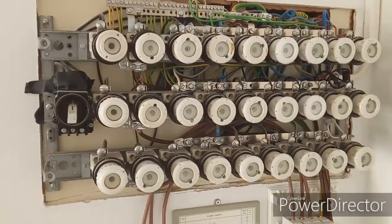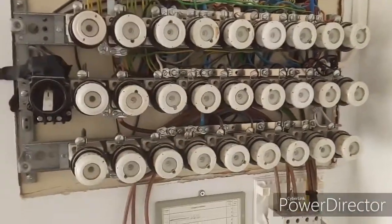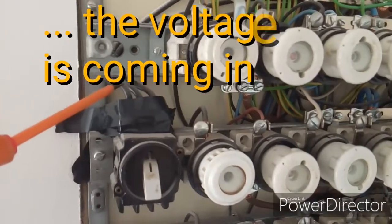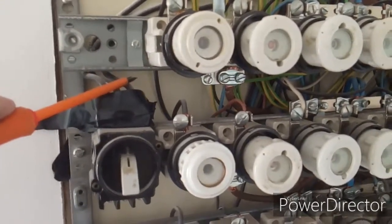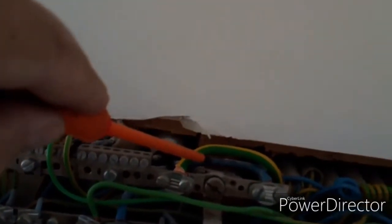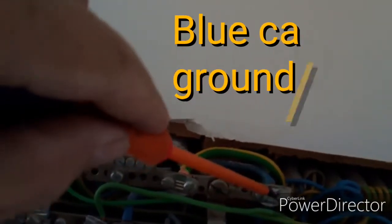Here is the central — you have a lot of fuses here for different purposes, and here you have an interrupter. The current is coming in through these three cables here: number one, two, and three — they call them phase one, phase two, phase three. You can see here in this little hole they're coming out, and also coming out is the blue line here. Normally it should be green and yellow, but the blue one goes to the metal ground and this is the metal zero.